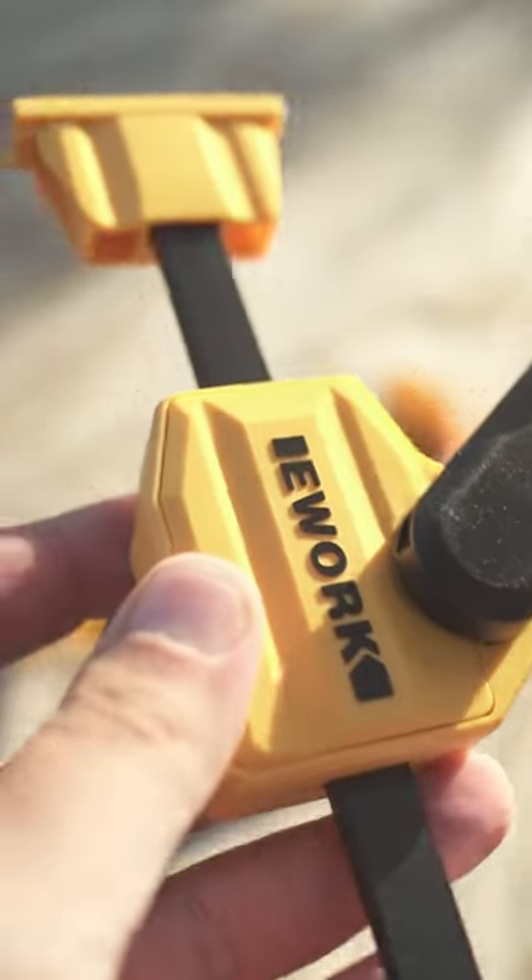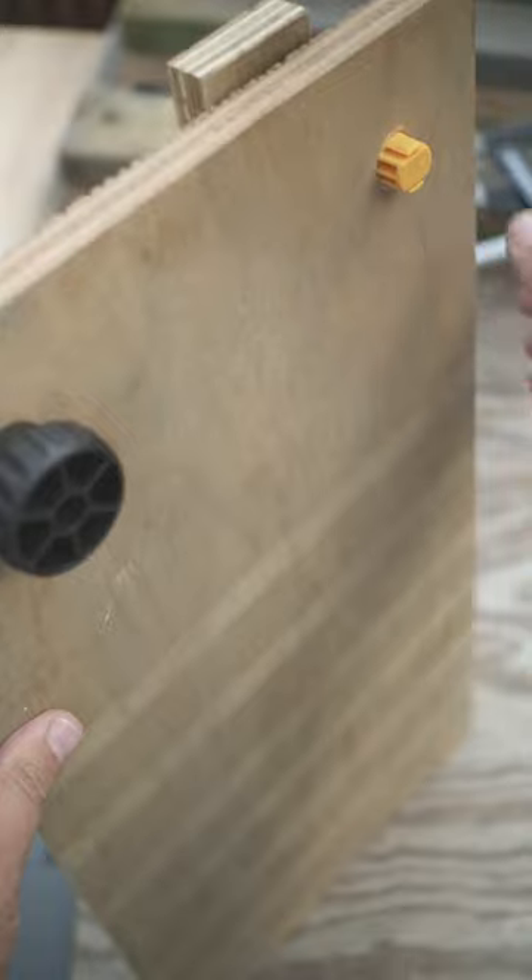The quality is pretty good, and just for the record, you need 20mm holes in order to install them successfully. In our case, we took a suitable Forstner bit to get the required hole diameter in place.